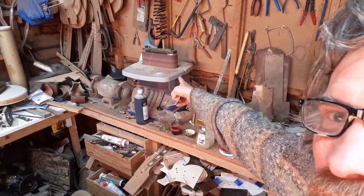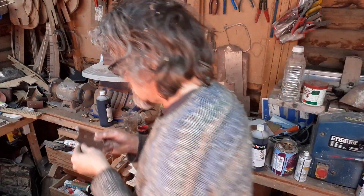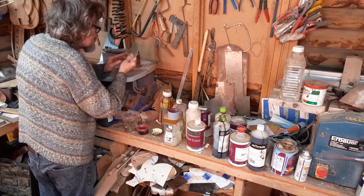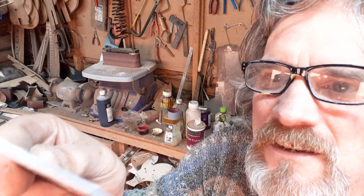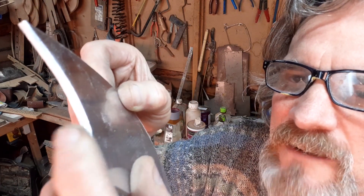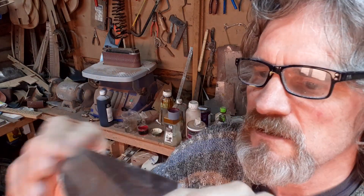I'll use my belt sander which is just over yonder — it'll be a fairly easy job. Watch me do it — make sure you chamfer the right side and not the back. I'll just do that bit to show you — you get a nice sharp-edged chamfer. I'm not going to take it right down to the bottom so I've got a square edge on the bottom and then a chamfer around there. I'll just get on and do the rest.